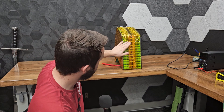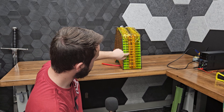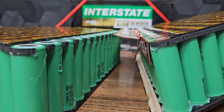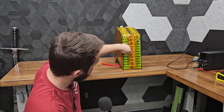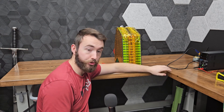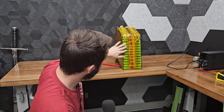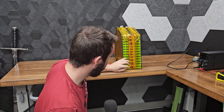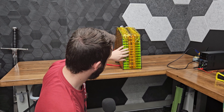There's another key detail I learned specifically with these two sides folded over next to the battery cells — that could have actually been really bad if I didn't catch it. What happened was these points that fold all the way over — that sharp edge kind of dug into the sides of the cells. If you know how cylindrical cells work, the outside is part of the negative terminal, so if the positive side finds a way to contact the outside of the case it will short and could start a fire. The way I remedied it is I stuffed in these acrylic sheets underneath — it's fairly thick acrylic and it definitely won't be rubbing through it. It's really solid now and there's no way it can be touching the sides through that acrylic.